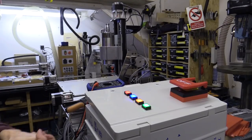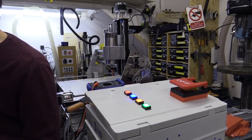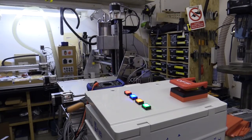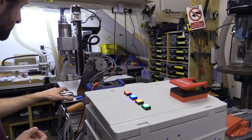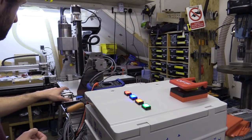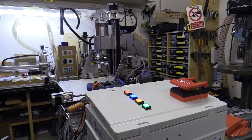Now if this is an emergency I'll press the blue button and it's going to suddenly stop. I'm not able to resume from this — I have to physically go to the software and reset it. I think my rapid speed is too fast, set to 1000mm a minute. I've now noticed that the hard stop will reset the machine position, which means I'd have to re-home after pressing so that the work positions are referenced from the right starting point. The soft stop may result in the work position resetting if, for example, I'd used a G92 command to offset an axis.